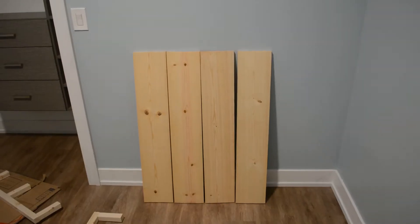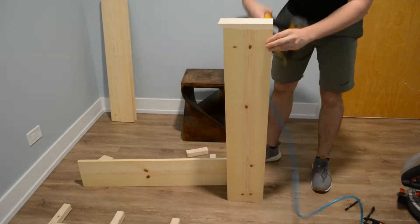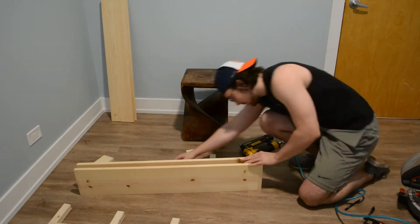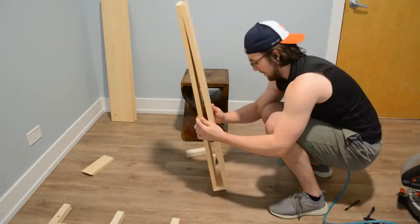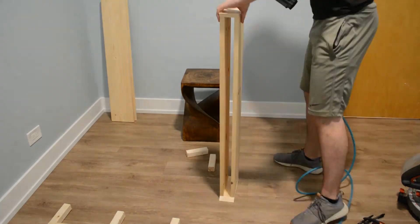Here's the material we'll be using for the top and bottom of the exterior of the floating shelves. To create this part you're basically building a box with the back side not attached, and I'm using miters in the corners and some 1x3 pine boards to connect those top and bottom pieces.